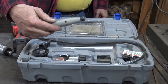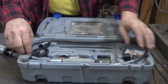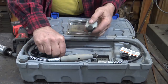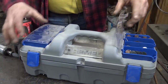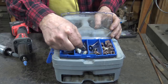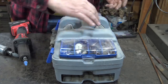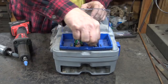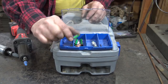It does have a little flex shaft, and this is a nice lightweight flex shaft. You mount one end in the Dremel tool and then you only have to hold the handpiece, not the whole tool, and that can be handy sometimes. It's also got a little power planer — I've actually used this for trimming up a door and it works, though not much for metal working. The kinds of things you tend to use in metal working are the little grinding discs and little buffers. I actually keep this in the wood shop rather than the blacksmith shop. I also have some little router bits and a little Dremel router, but I almost never use it.